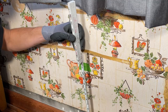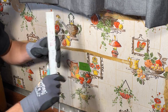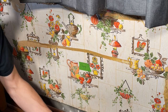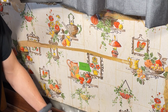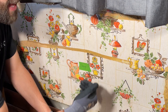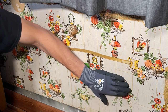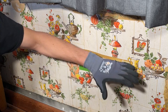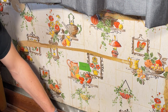Time to cut a hole. I'm 11 inches above finished floor to the bottom of my box, right at the shelf on the wallpaper. A typical home built today would be about 15 inches to bottom of the box, but we're matching existing. One of the most important things is the measure-twice, cut-once concept. Pull out your stud finder and find where the studs are. This is a plaster wall with lath behind it, so a traditional stud finder is not going to work. You can knock the wall and listen, use echolocation, or check your trim for a 16-on-center nail pattern to identify where those studs are.